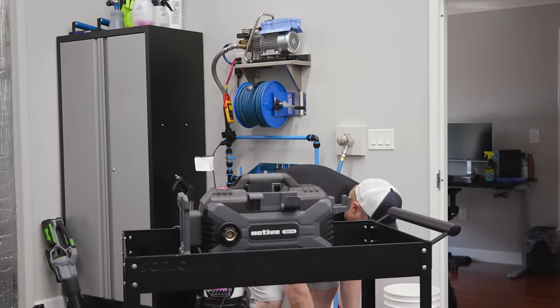What we do include in the box, do we leave the 1.1 in with the active? So we decided to do that. It's probably a mistake, but we do leave the 1.1 millimeter orifice. If you use the 1.1 on this, you're probably gonna blow it up. So don't do that. Use the 1.25 that we pre-install inside of the foam cannon. So the foam cannon comes like this, and we used to torque these all down for people, and then it just depends. It depends on what day it is, on what people want, but you can man up enough to get yourself a 14 millimeter wrench and tighten this thing down.